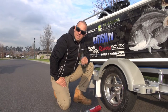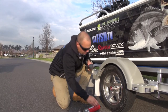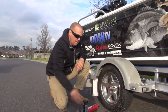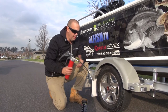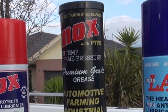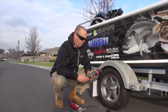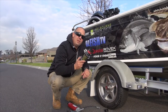One part of our boat that a lot of us forget and don't think about is our bearings. We're very lucky with these trailers that we've got — the Spitfire ones. What they've actually got is a bearing nipple straight inside there, so in order to do our bearings we don't have to muck around and get the whole wheel off and all that sort of stuff. All we need to do is get our inox grease, load it into our grease gun, and plug it onto the grease nipple. So when you are greasing your axles it's really, really important to use a marine grease.